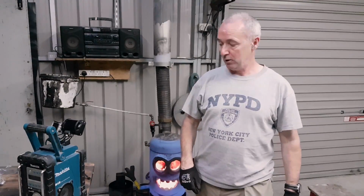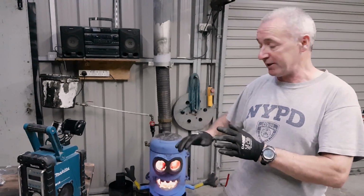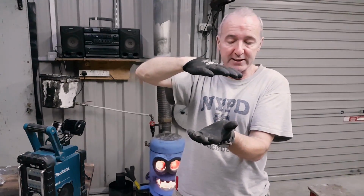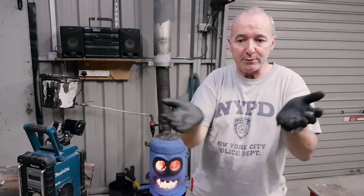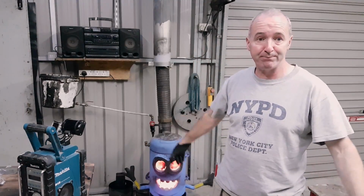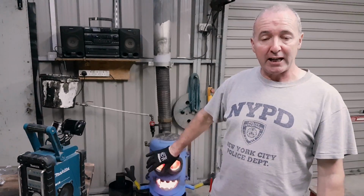Okay, so I'm going to show you inside the stove now, that brake disc that I put in. It's got a bit of a slot cut out of it, and that was for a different burner unit I had. But essentially it's just a car brake disc. Nothing special about it. But what it does is concentrate the heat within the vaporizing pot and force the flames out along the side, which is why, look, they're burning clean. So this unit does burn clean, or is capable of burning clean.